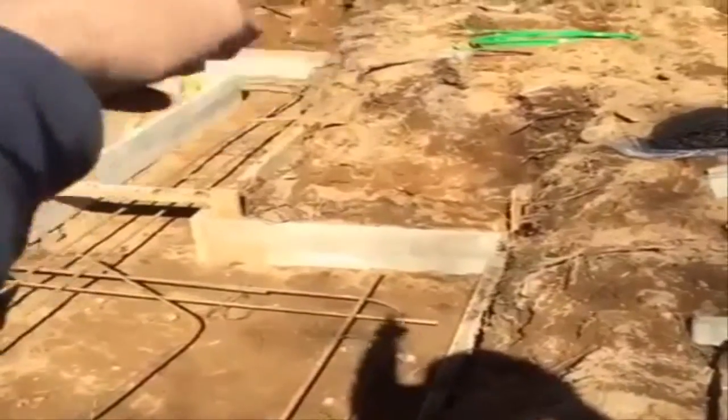This area here is going to be the steps. The front porch is going to come out three feet and go all the way across to this point. When it gets to this area over here, there's going to be a set of steps and some piers coming in two feet off each end with the steps in between.